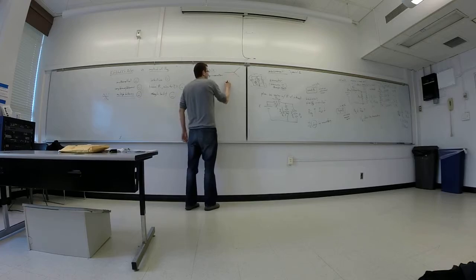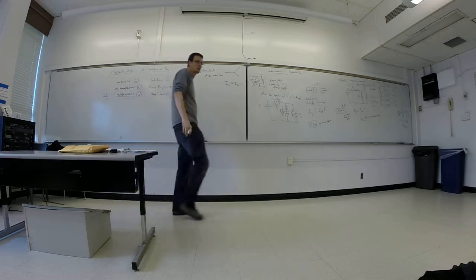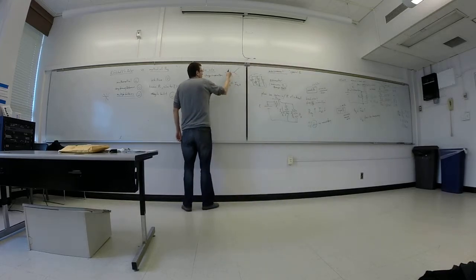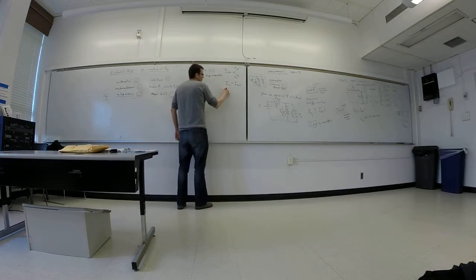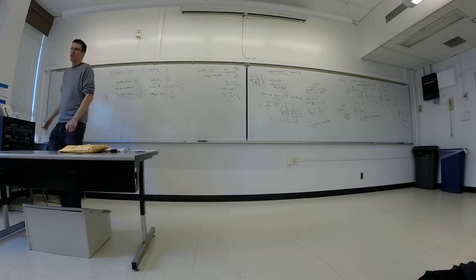So what we basically have, the junction rule is basically this. What goes in must come out. That's it. That's the junction rule. What goes in must come out. Now that can, of course, take on many different forms. Like for instance, maybe I have the current coming into the junction that I call I1, and then I have two currents coming out, and they're I2 and I3. So in this case, the manifestation of the junction rule would be that I1 comes in, and I2 and I3 go out. So that would be an example of a junction rule you would write down.